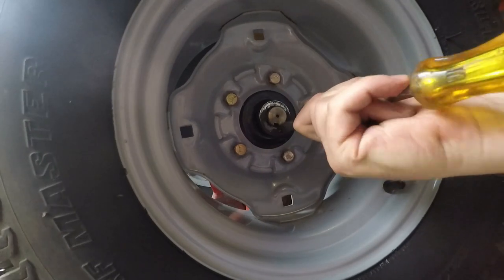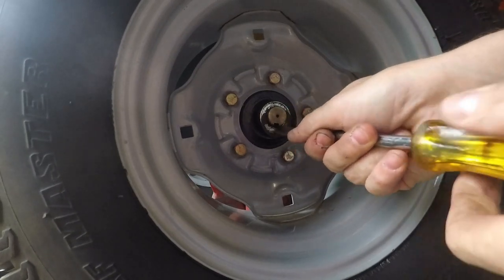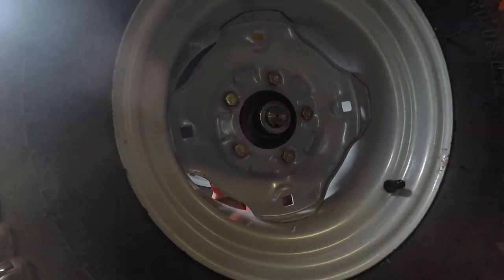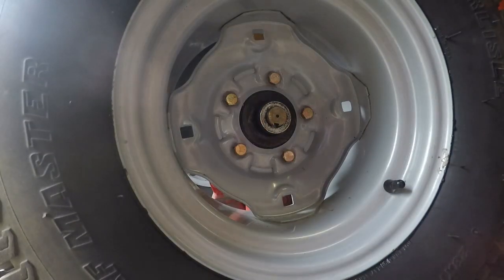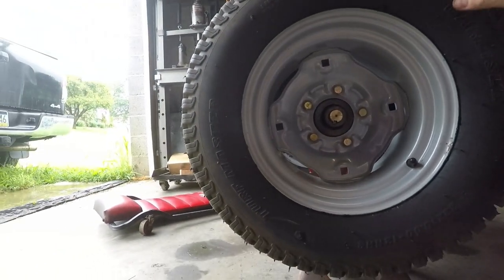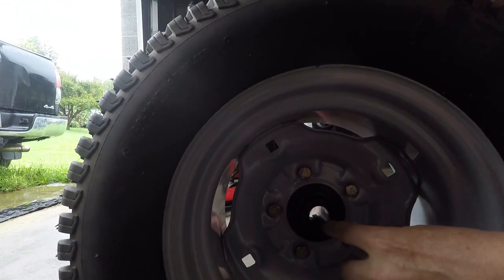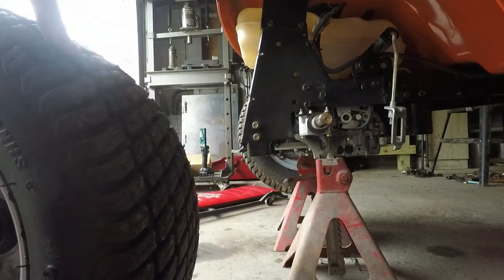I'm kind of turning here, and then right in the center — you don't want to lose that. I could have took the lug nuts off, but I don't want these hubs on here either; it would just make it even heavier. Then it just pulls right off. Be aware you've got a key in here — you don't want to lose this. Might as well take it out and put it in your rubber cap. Now I'll just repeat this on the other side.